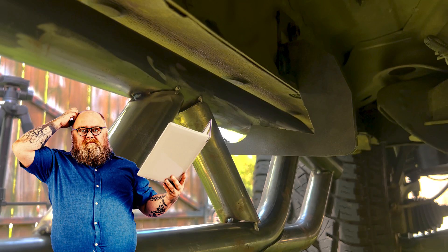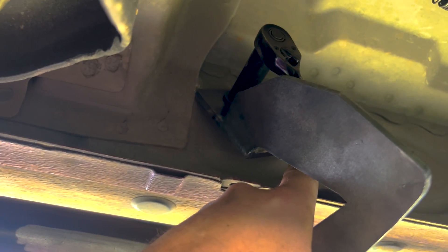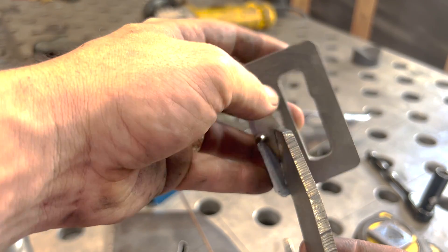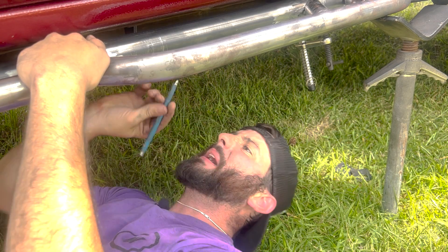Let's pick up these jacks. We're not quite touching there - we're touching there, but this guy is just not doing anything right and that one is just clear up, straight up not touching. I could roll this and get this to sit better, but it still stays off of that. My concern is I'm going to have to move this bracket to the other side of this plate - this is the only one because of this corner, this cross section here, it's in the way. And if I take this out, everything sits right. So I've got to modify this. We'll pull the step back off, flip the bracket around so that it clears the spot I need it to clear, put it back on the truck, put the other tabs back on, and lay out where the brackets need to land so we can get it ready to weld. I definitely don't miss making a living on my back, that's for sure.